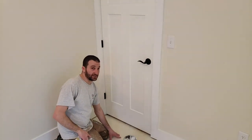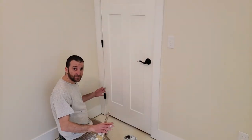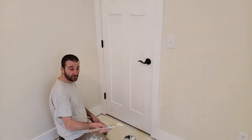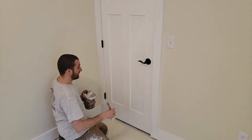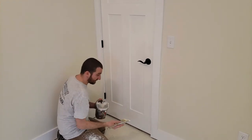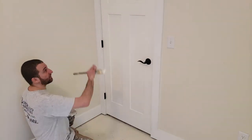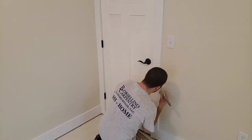If you're doing this on a finished floor, you're definitely going to want to use a drop cloth. But this is just plywood subfloor so I'm not worried about getting any paint on it. Some people might think there's a specific way you should go left or right — I think whatever feels best for you is the way you should go. I generally like to start somewhere there's a seam and then work my way rather than start in the middle of a board. The key to this is always having a wet edge, which means you want the paint to be wet. If you go too slow and it starts to dry and then you go over it, you'll start to see lines. So you want to go as fast as you can but as nicely as you can too. With new trim, I just paint the trim and get it onto the wall and I always cut the wall in afterwards — I find it easier to cut in that line. With door trim especially, I always paint onto the wall and then cut that in with the wall paint.